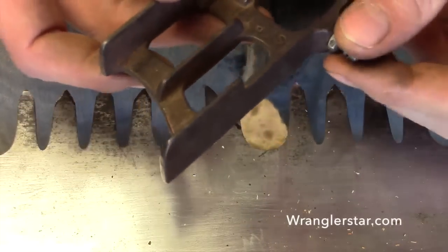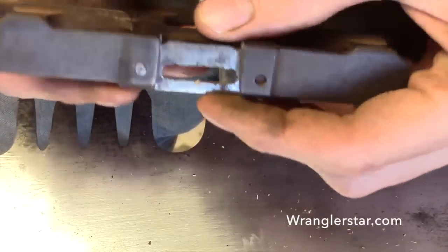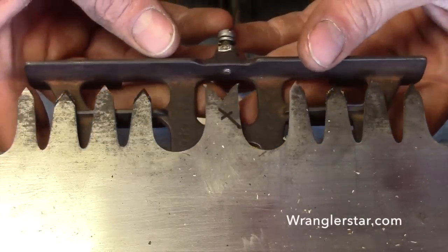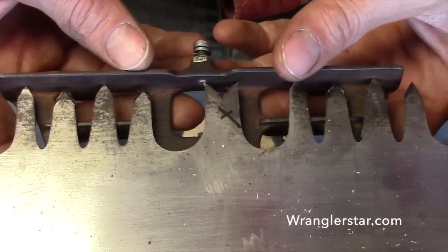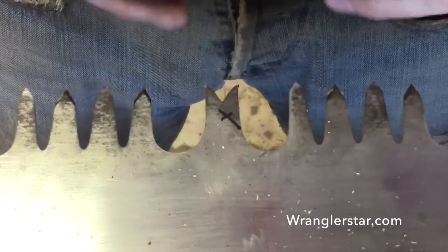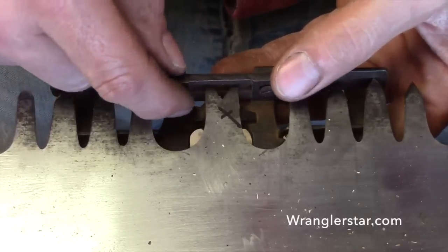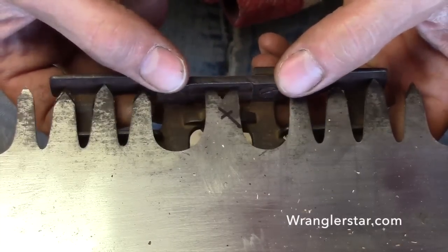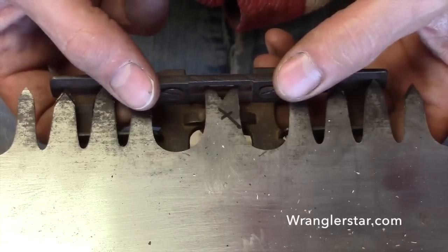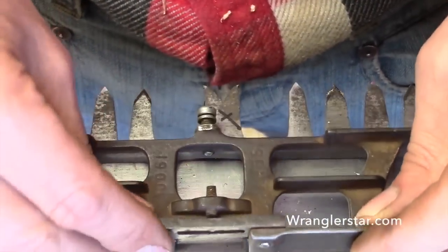Now that we've got our pin gauge all set up, we have to set the other side, which is the raker gauge, and this being the filing plate right here. So here's the little guy that we had. We are 9/1000ths, just skating across there, that's perfect. This being a combination gauge, it does two things. We want this to be 3/1000ths lower than the points. So off these points, that means 12/1000ths. So it's adding three. These are actually pretty simple to adjust.